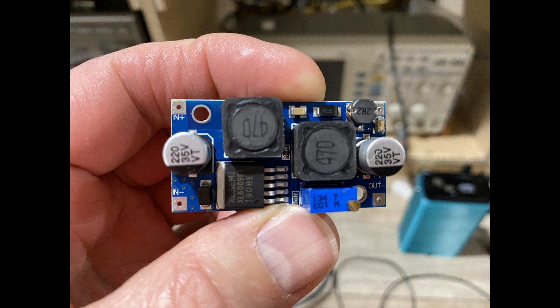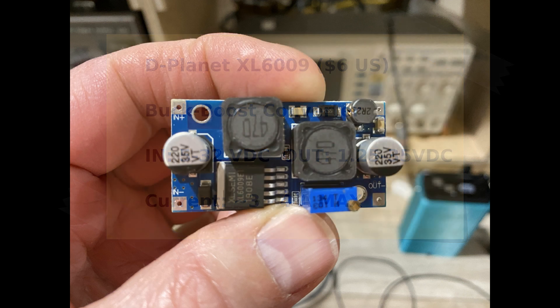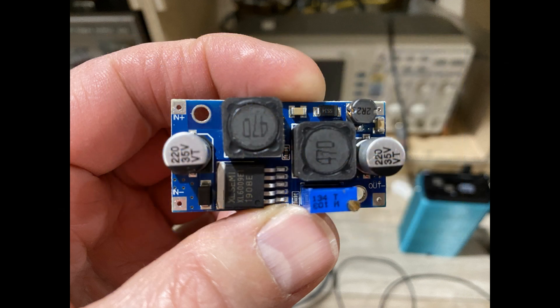I'm sorry to cause you so much stress by leaving a glaring design flaw in this project for so long, but let me put your mind at rest. The output voltage of the battery pack is going to range from about seven and a half up to 12.6 volts worst case, and the radio needs 9.6 volts. So how are we going to solve that problem? Enter this little device — a miracle little device, actually — called a buck-boost converter. It can accept a very wide range of input voltage and can be adjusted to produce any output voltage in its range. And 9.6 is within its range, so that's where we're going to set it.